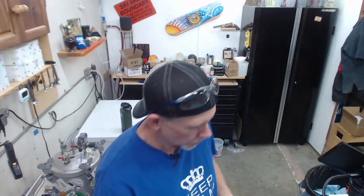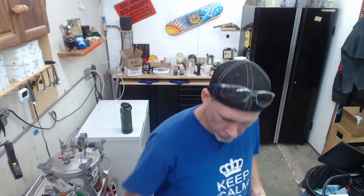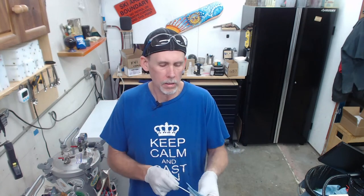You don't want to pull that out before then, because, for anybody that doesn't know what the deal is with this pressure pot thing, what's happening is you put it under pressure and it collapses air bubbles. It shrinks them, basically. The same happens with vacuum, but the opposite way. Vacuum is going to make them expand. So the pressure pot's great because you put it under pressure and immediately those bubbles collapse.